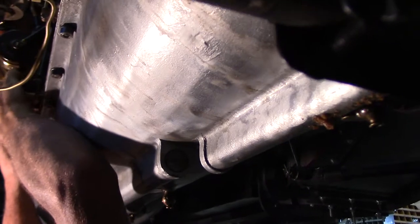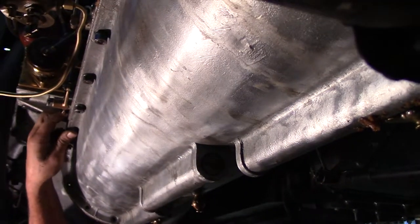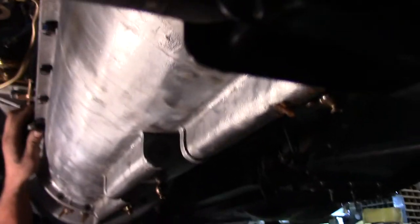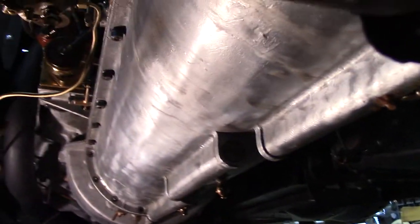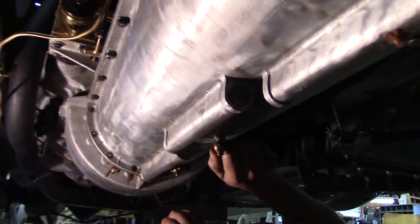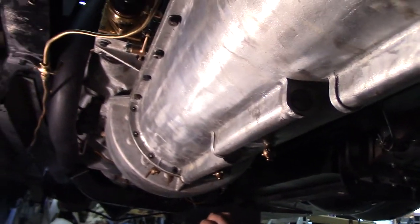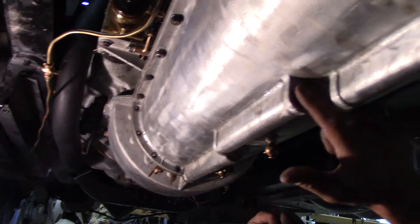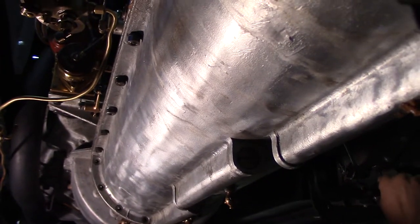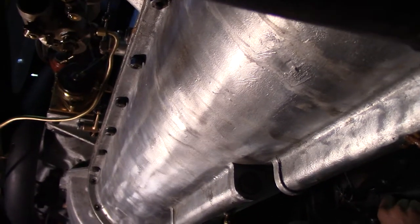Here are the clean-out channels with a big screw in them. This oil pan has a standpipe on each of these, and you open it and make sure oil drips out to check your level. Then when you change the oil, you pull these plugs out and run something like a gun cleaning rag through there to clean all the sediment out.